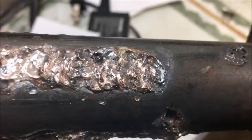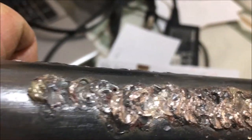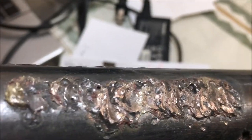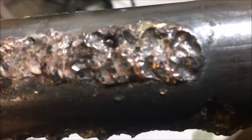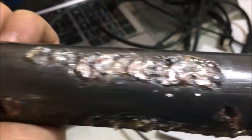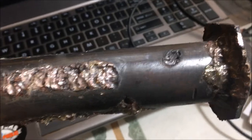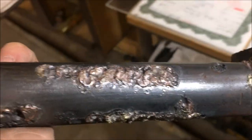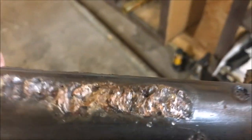And then we got to this here where I started to develop the technique of making the arc hit the brazing rod first just a little bit. And then after you get some material down, walk back over it with the arc bead. So, don't know that I'm going to take this any further based on these results. It was just too hard to do, and my helmet was constantly turning off and on, so it blinded the hell out of me.